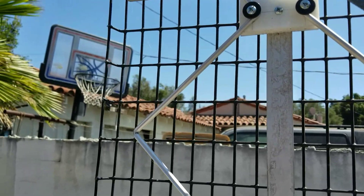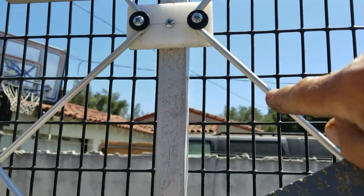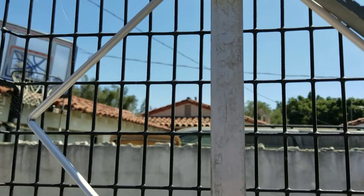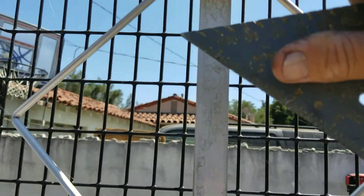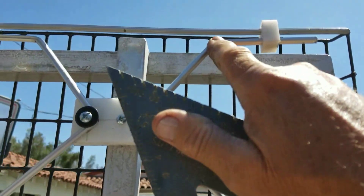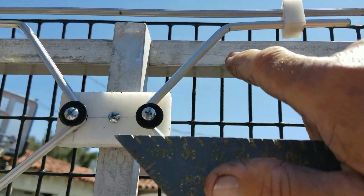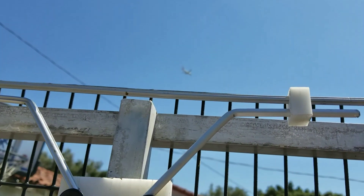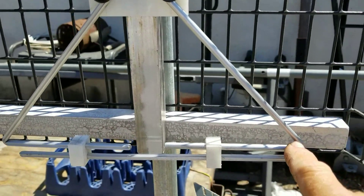Up here, because I ran out of rod, this distance is half of one of those diamonds — as you can see if I put that right there, it's just half of one of those. This whole distance is the length of that whole piece; if it wasn't bent here it would go straight up and be the start of the next diamond. So I went halfway across, took a measurement, and then just bent it over on a 45-degree angle so it came out this way on both sides.